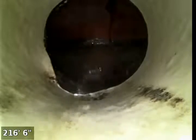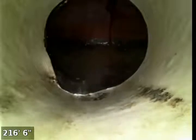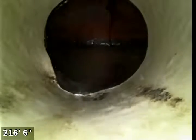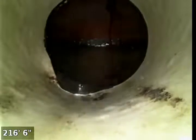Okay, you can see our water is finally slowing down from when we ran all the faucets to get this pushed out. So it does look like this is a lined pipe. You can see the little bit of flared piece on the left side of the pipe there as we move forward. And so there you can see the clay concrete pipe, the orangish reddish clay pipe. See all the water running there from left to right. That's all the neighboring properties throughout the neighborhood.